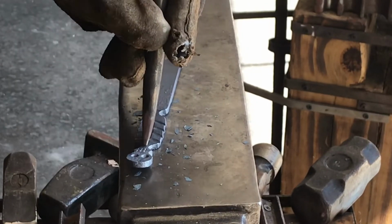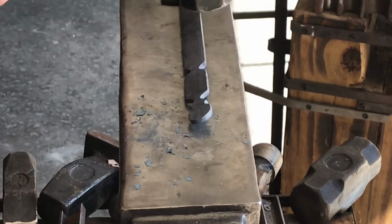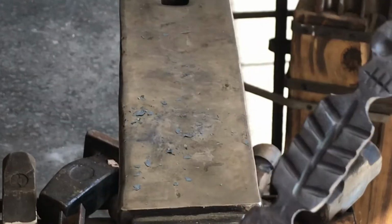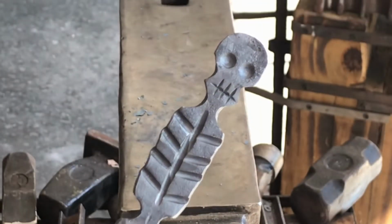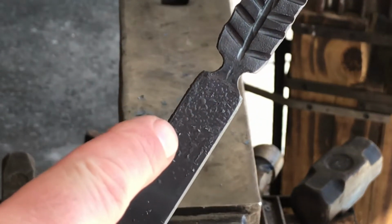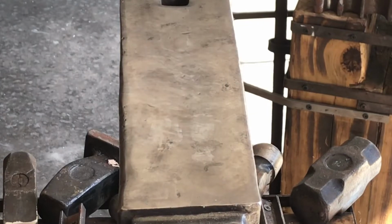And there you can clean up the center line with it good and hot, even though it's at a black heat right now, which is just fine. And there you can see it's all deepened in, cleaned it up a little bit, clean those lines up a little bit, everything looks good. Next thing we're gonna do, come through right there, and we're gonna punch a slot in it.